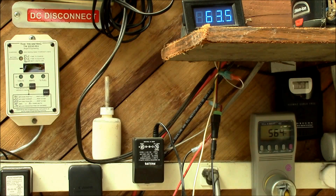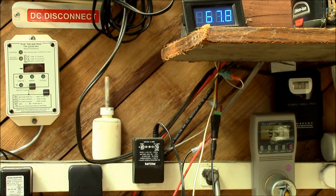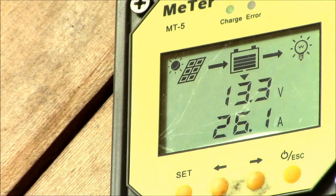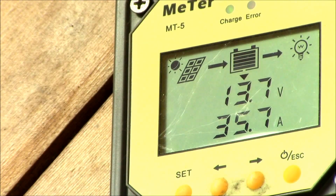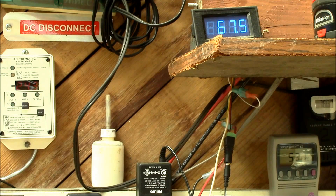This is the agitator cycle. We're pulling about 44 amps out of the batteries. I'll swing up here to the charge controller — pulling about 30 amps off the panels. I'll go shut off some of my DC lights. There, I shut off the DC lights and you can see we're up right around 40 amps — it's a 40 amp charge controller.